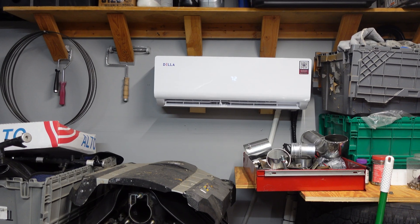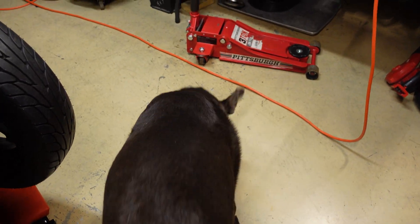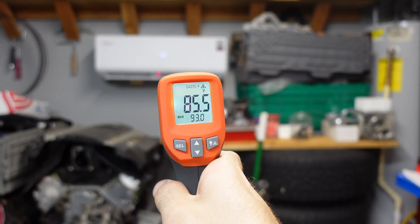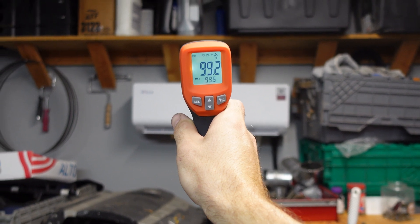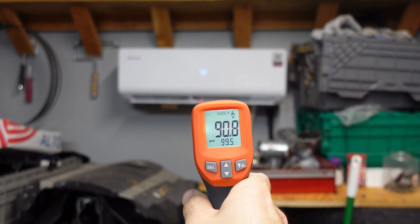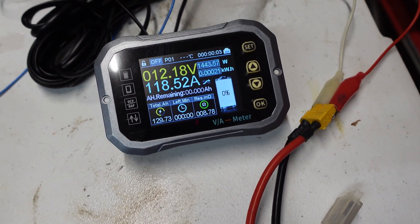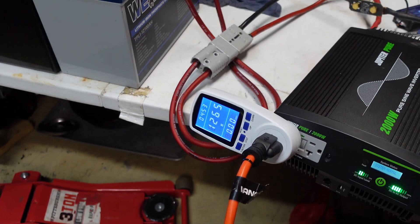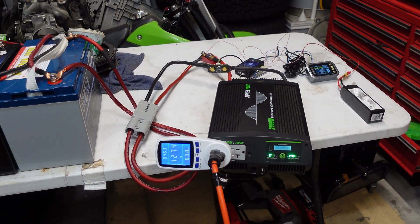We're back inside. The air does feel cool. I'll grab a temp gun so you can see it's actually cooling. Pointing the temp gun at the ambient air — almost 100 degrees. The temperature out of the AC unit reads 86 to 90, but I don't think I'm getting a great reading. I can feel with my hands it's definitely blowing cold. On the DC side we're pulling about 1400 watts, and on the AC side we're putting out about 1260 watts — so you can see the inverting efficiency losses, about 200 watts less out than in.